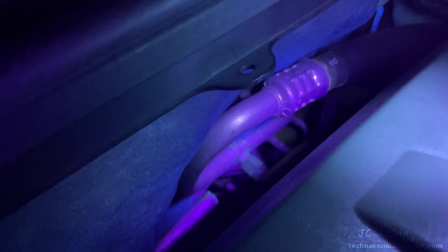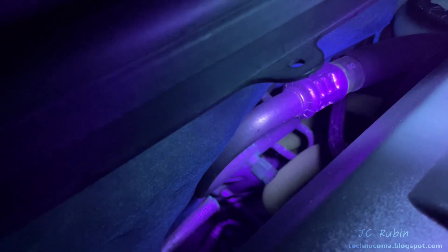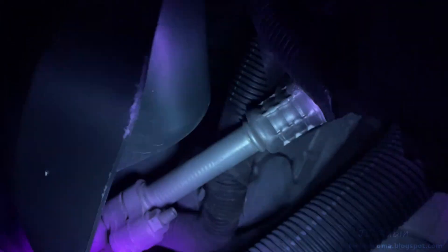I'm at the low side now — there's the return and the low side fitting right there. I know from the factory they supplied dye, but I don't know if the refill had dye in it, so I may be chasing nothing right now. But I'm still going to look anyway. Now we're up front — I hadn't gained access to this area earlier — looking for any leaks. Every area where there's a junction fitting or connector requires special attention.